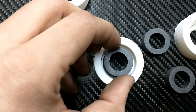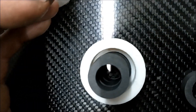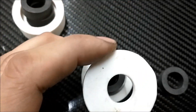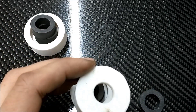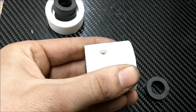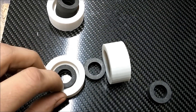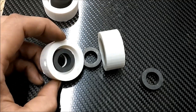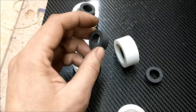I'm going to glue them all together before I glue them into the casing. As you can see, there's a little ring where air can get around the bearing, then we put our cap on top. It's got that little holder right there, and our air entryway right here will evenly create a ring of air around the graphite. The porous medium will levitate the shaft — that's how our air bearings work.